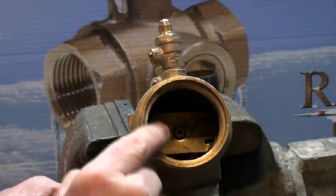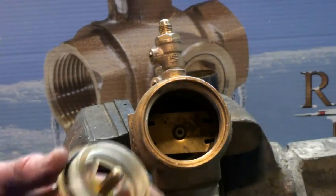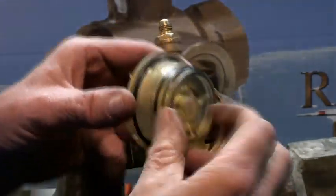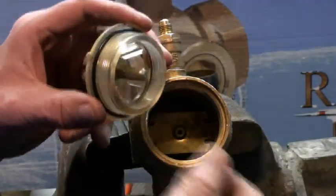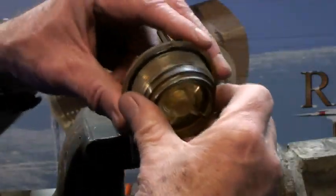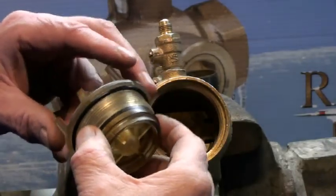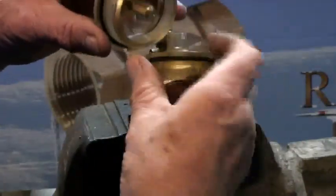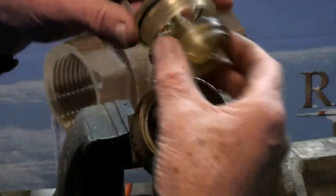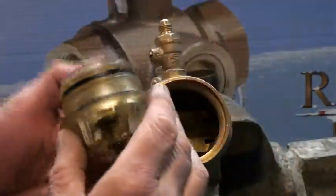What you don't want to do is put that grease on the stem to lubricate it — that grease is thick, it's like Vaseline, and it'll just be a film of gumminess. All greases, lubricants, and oils are dirt magnets — they will attract dirt and could make that malfunction. This stem is made to be water-lubricated. So just use the grease for the o-ring.